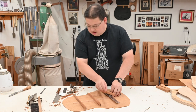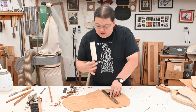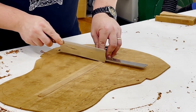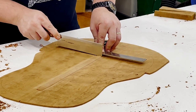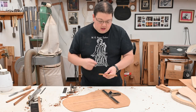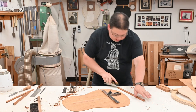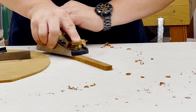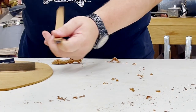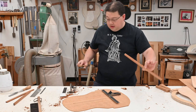With the brace held into place, I'm going to take my little razor saw — it's a very fine micro-bladed saw — hold it right up flat against there, and just cut very gently down through the back brace. At this point I always realize I want a nice surface on both sides of these, so I'm going to take my trusty block plane and do one or two passes on this side just to remove the sanding marks, then flip it end for end to obey the grain direction and do two passes on the other side — and that's all I need to do.